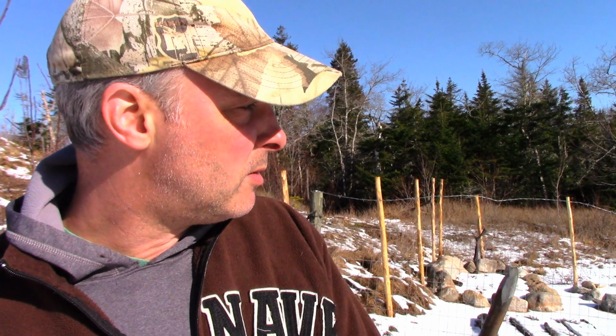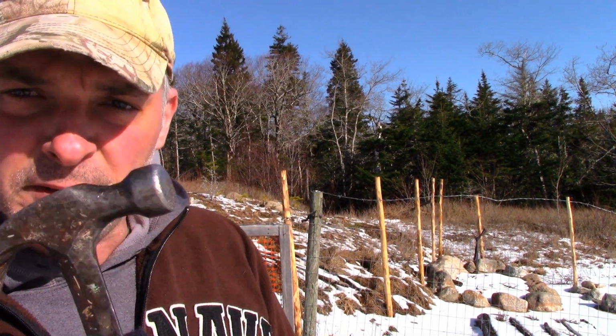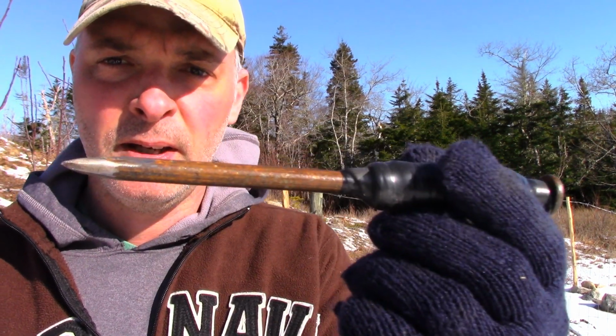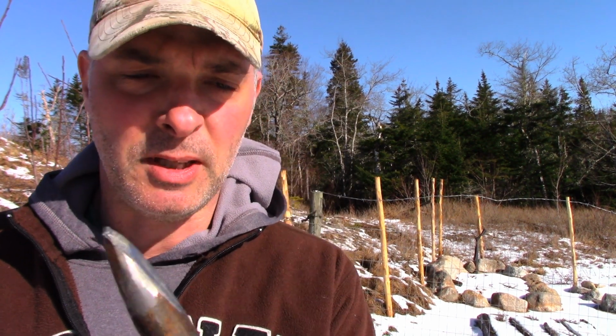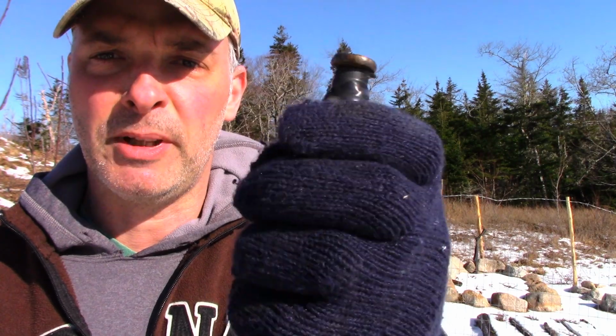We're doing everything on the cheap here and trying to avoid going to the hardware store, so I've fashioned a tool. I didn't want to use a good screwdriver to pull these things out. The fence nails, I think they're called, look like a giant staple and are difficult to hammer in. You need something relatively stiff and strong but pointy to pull them out. So I got this 6-inch nail and filed it to a kind of semi-flattened, relatively steep point. And I put a little bit of inner tube rubber around it with some electrical tape.